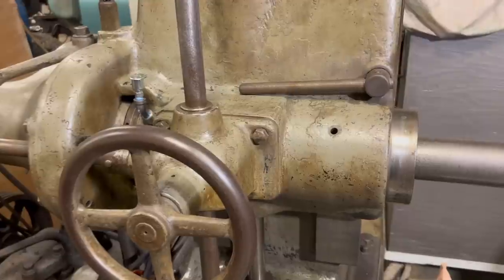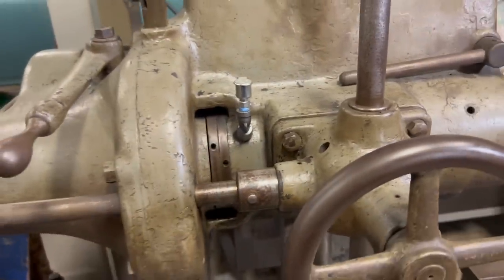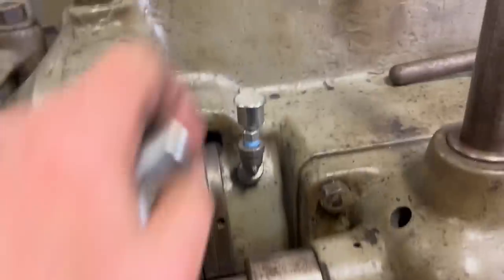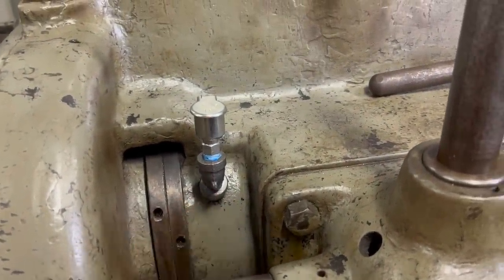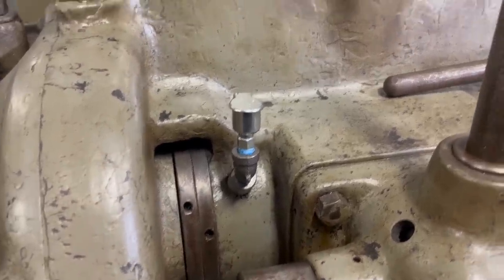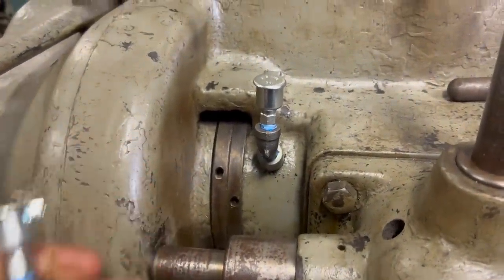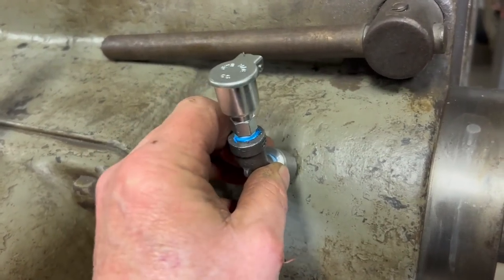Here we are on the final phase of the oil drip cups for the headstock of the Lucas horizontal boring mill. I put this one in and it fits good — the last eighth of an inch I had to tap in with a square-nose punch. It's a pretty tight fit but I'm sure I can wiggle it out. I want it to be removable. I did put a little bit of black silicone around the top half to glue it in. The second one just goes in and will stop about an eighth of an inch up from the top.